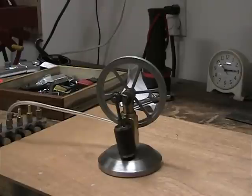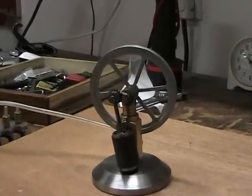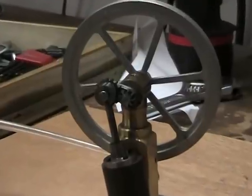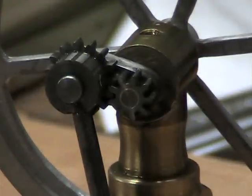There's two gears. I'll zoom in here so you can see. There's one gear that's a nine-tooth pinion that's fastened solidly onto the crankshaft — that goes to the flywheel. And then the other gear, which you can see around the outside, is a 15-tooth gear that is affixed solidly to the piston rod.